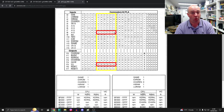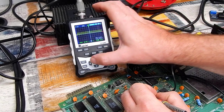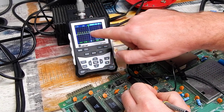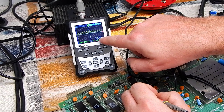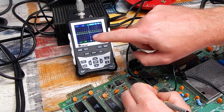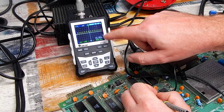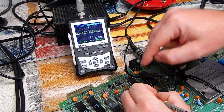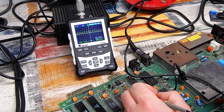Now, the reason that I'm focusing in on address line 12 is that if we take a quick look on the board again with the oscilloscope, there it is. It's like a sawtooth type pattern, but it's only peaking to a maximum of about 2.9 volts. That would not be enough, I don't think, for the TTL logic level in here to call that high. If we take a look at the same signal on my other C64 board,